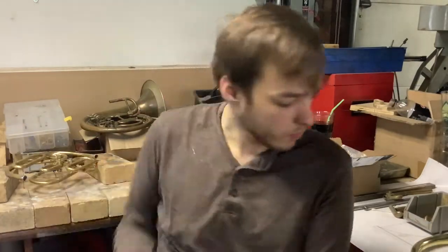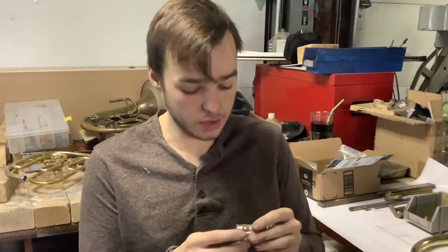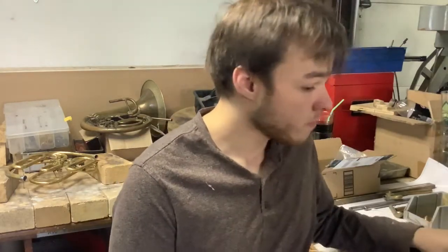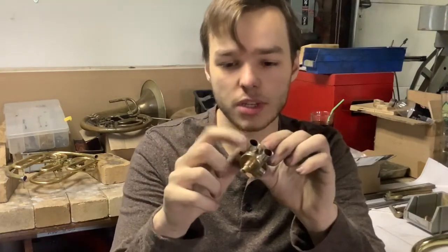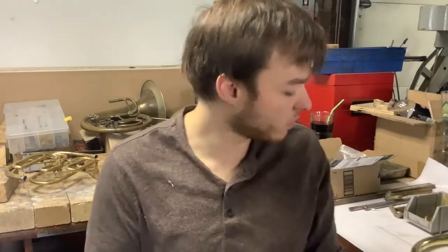These are the exact same size valves as my rotor trumpets, except the knuckle orientation is different. You can use the same machine components and just switch the balled-out tube that goes into the casing holes, and you have completely different instruments. Here's a finished — or ready-to-be-finished — valve. We're going to be making and brazing in the knuckles for the rotor, which is my favorite part.